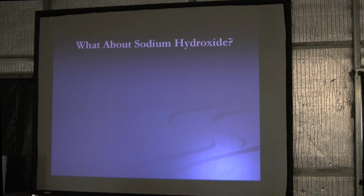The old guys never used sodium hydroxide. They always used potassium hydroxide. And I never got good results from sodium hydroxide either. Got a lot of bloom and a lot of sludge. Sometimes I got a good silver coat, sometimes I didn't.